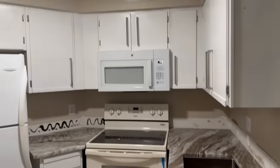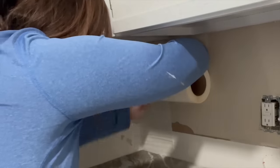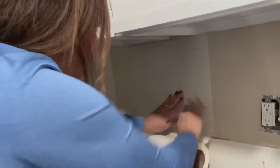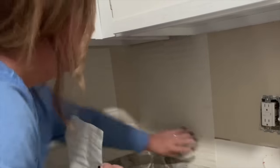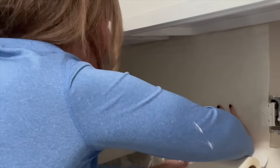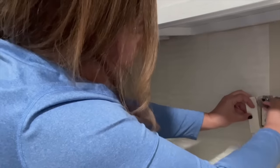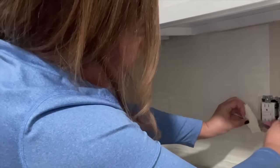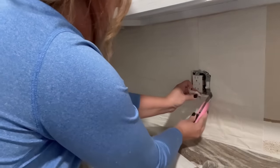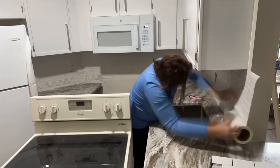After updating this 1980s kitchen, I knew it needed something more. I wanted to add a backsplash but didn't want it to take long or create a mess on my new countertops. So I decided to use an adhesive tile mat along with mosaic tile sheets, white grout, and a sponge to complete this project start to finish in just one day. I found it best to hold the roll up against the bottom of the cabinet and allow gravity to help it hang down straight. When it came to the outlets, I turned off the power and cut the mat with a razor blade to create an opening around the outlet and disposal switch area. It took me only about half an hour to cover the entire backsplash area.